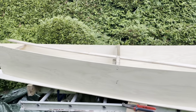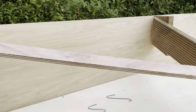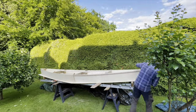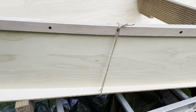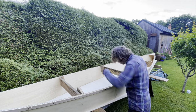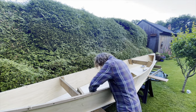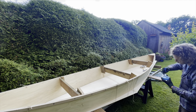I've been doing other stuff while it's been raining, including cutting out these gunwales which are to run along the side. I've fastened the base on with strings. To fix the base to the sides I used a thickened epoxy resin — just plain flour mixed with epoxy. Then I overlaid a layer of glass fibre tape and then fresh epoxy on the top to finish it off.